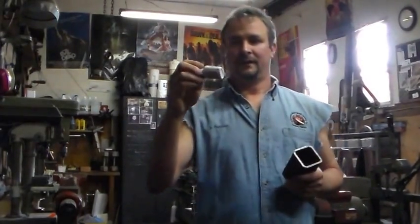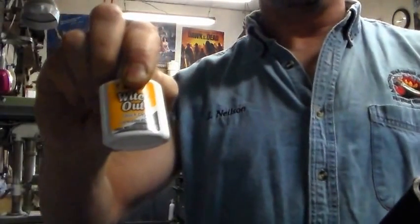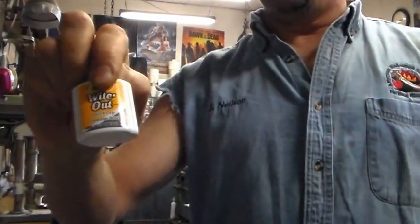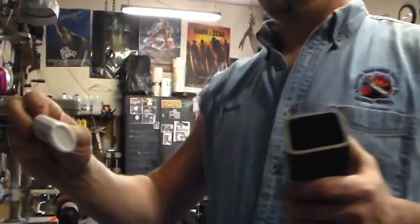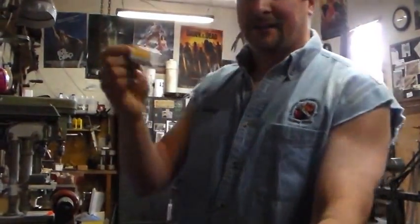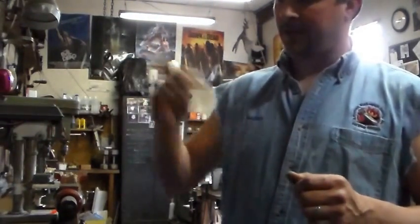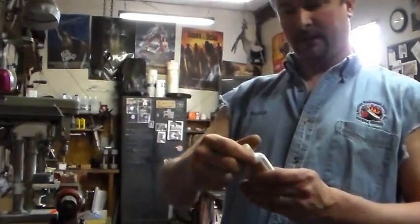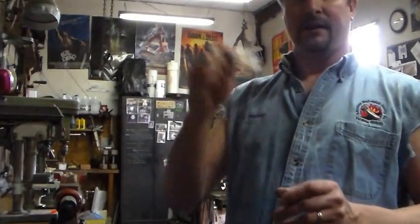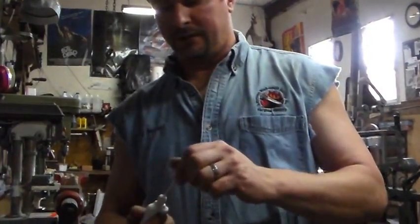A very good friend of mine gave me a tip on using whiteout. I don't know if it makes a difference if I have the name or not, but it's a regular Bic whiteout — anything pretty much works. I had a problem with whiteout in Canada, but I get this cheap whiteout from the dollar store. A friend of mine, Rob Decker, told me that something about the zinc or zinc oxide in the whiteout prevents the can from welding to your good steel.